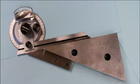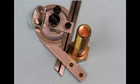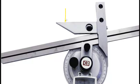This photo shows the universal bevel protractor checking a part. The part would be set in against the base, and with the lock nut loosened, this blade would then be brought down into contact with the far side of the part, and then the reading is taken off of the scale here. This is an example of the angle being checked on another part. This picture shows the acute angle attachment, which has been added to the base of the universal bevel protractor. This is used to measure angles smaller than 90 degrees.